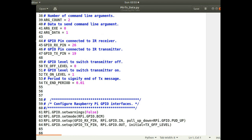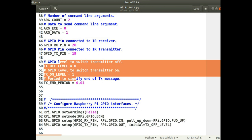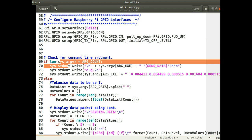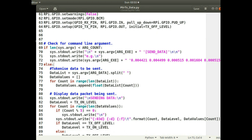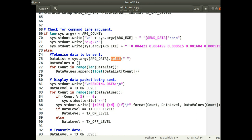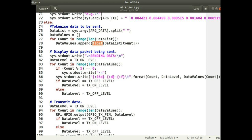For the retransmit script, the constants are the same, it takes an argument at the top, and the GPIO pins are the same — again simpler with just level and end-period definitions. The GPIO pin setup is exactly the same as in the previous code. If no argument is given, it prints an example of how the command is used. It then splits the data argument into individual floating point numbers, iterates through them in a loop, and adds them to a list of floating point data values for easy playback.